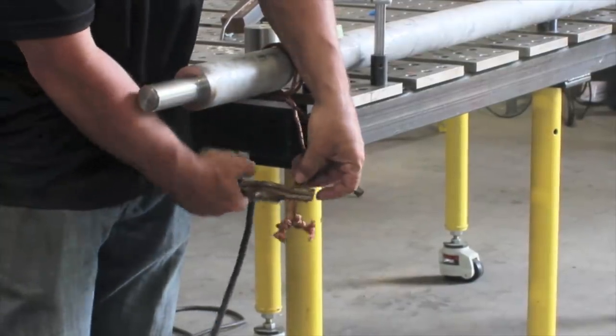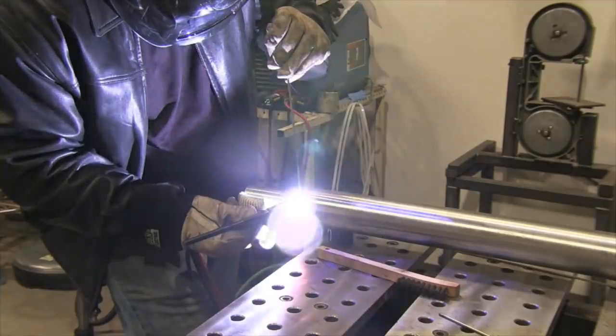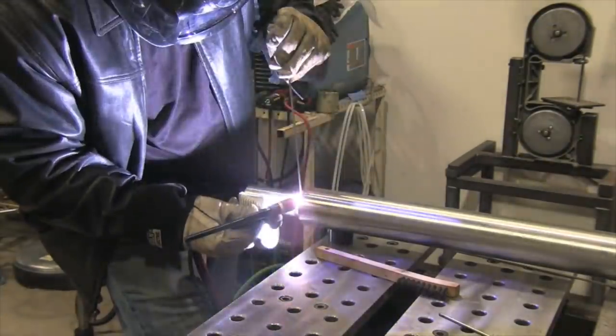A good tip: get some braided bare wire from an old ground clamp - it makes a great ground for odd-shaped parts that are hard to clamp. Here I am free-handing and propping again with a TIG FINGER because this thing is getting hot after the second pass. This is just a journal that I'm welding a radius into so it can be remachined.